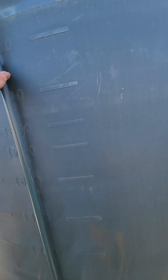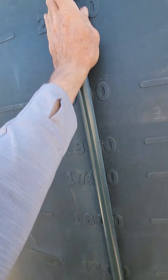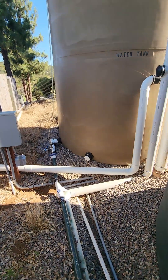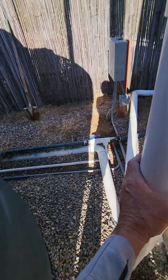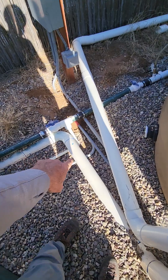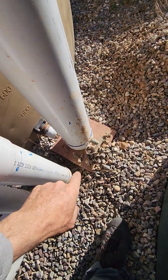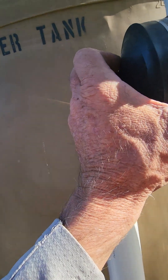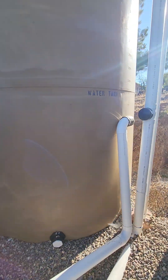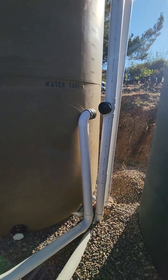On this job we placed an incoming city water line in the same trench — a three-quarter inch inlet the homeowner will hook up later. The water comes out of the ground from the house in this 4-inch pipe. This is a 6-inch first flush device that I built — that's the sediment trap, and it can be cleaned out. Because we've had so much rain in California, the overflow has to be thought about. When the tank system is full, the overflow is hooked up and it runs out to the street.